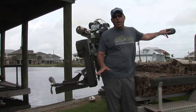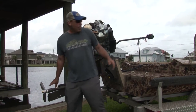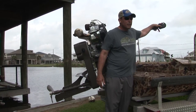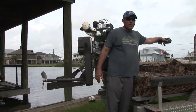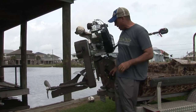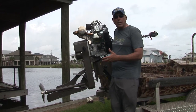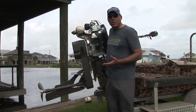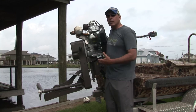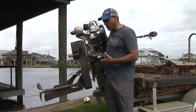Let's talk about the trim on these mud motors. We've already established that when you hit something, the motor kicks up freely. There's a trim unit on here, and that sound may be familiar to you because it's a Mercury-built trim — the same trim unit used on their 90 and 115 motors. It's rated at 8,300 pounds, though this motor weighs nowhere close to that. So it's over-engineered and over-built to take the abuse they know you're going to deal with on a mud motor.